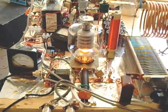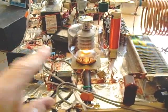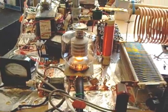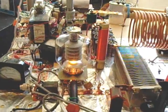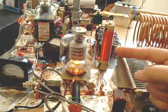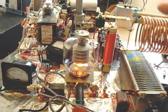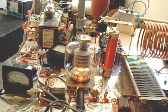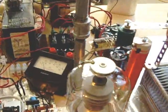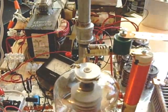I'm dealing with the linear amplifier with a 3-500 tube. I've made a few changes from the last one. In this case, we have a choke here which I've made — it's 170 microhenries. And the parasitic choke, which is this thing right there sitting on top of the tube, is one that Ameritron uses in their linear amplifiers.